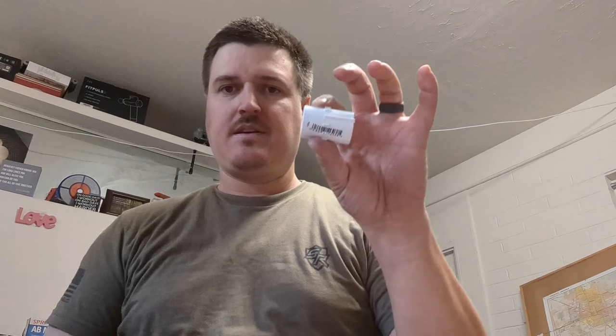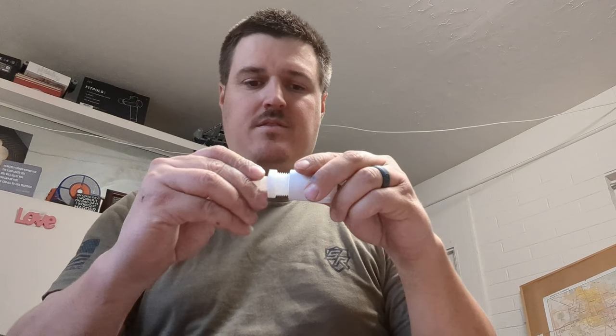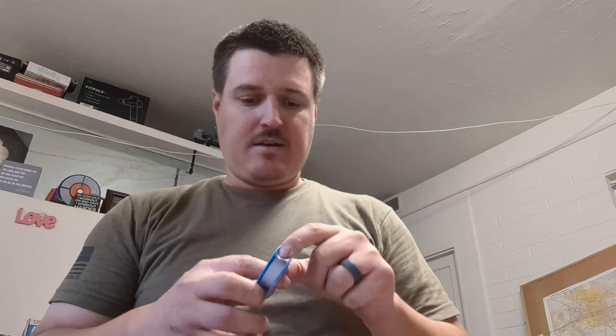Here's that half-by-half adapter, and here's the PVC connector. It eventually screws in, so if you ever do need to take it apart or whatever, you can always unscrew it. But before you screw this in to this piece, you need Teflon. It can be any kind of Teflon that is made for water. There are different kinds — some are used for gas — but because we're not working with gas, we don't need that.